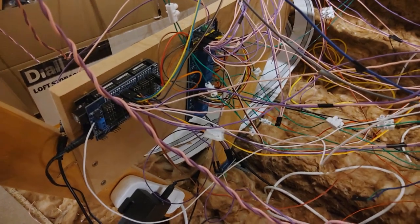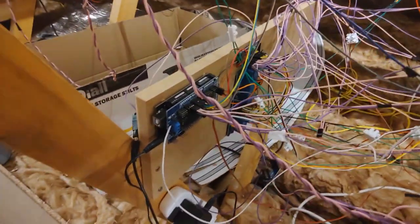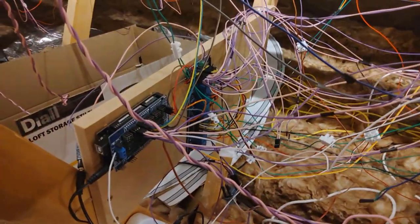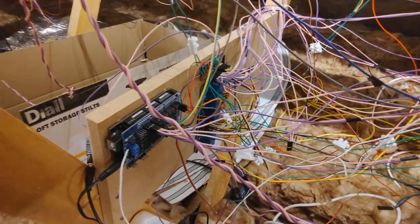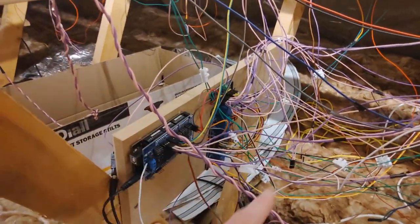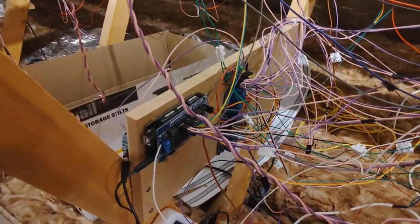Down at the very messy Arduinos, the grey cable at the top is the common ground bus wire coming through. There's a connector that comes off the white cable and it goes into the ground connector on the Arduino sensor hat. The reason I did that was my usual laziness - the Arduino is connected to the PWM driver board which has a 5 volt and ground connection, and the TTL module is powered from that PCA9685 board. So as long as I plug the common ground into something on this little hub, that's all connecting and talking to each other.